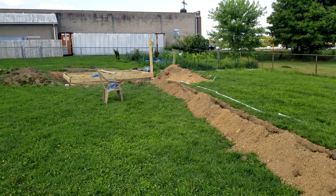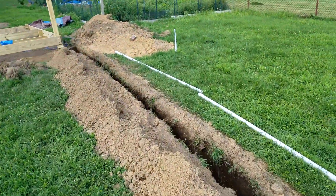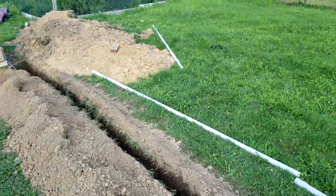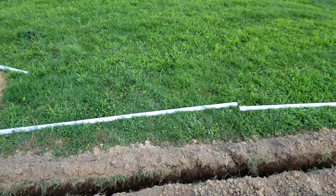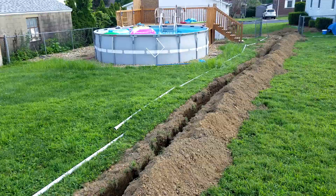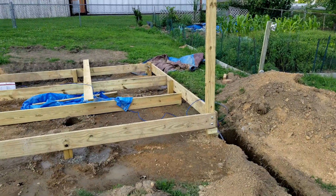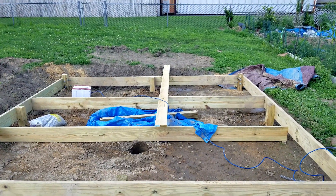Got down 24 inches in most spots. I've already laid down the 10-3 with ground, covered up with dirt, and put the caution tape down. Technically that should be on top, but I'm going to have a one-and-a-half-inch pipe on top for the data — three gigabit ethernet cables inside and one security cam wire for the camera that will sit up on that post. Everything will come to this corner and then go under the joists or under the floor.